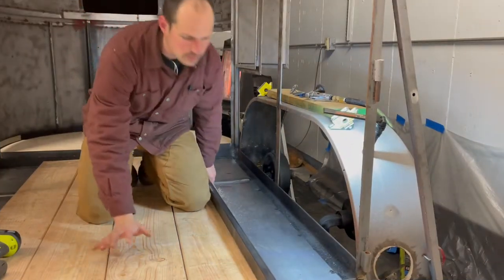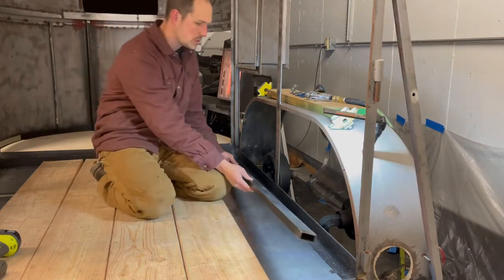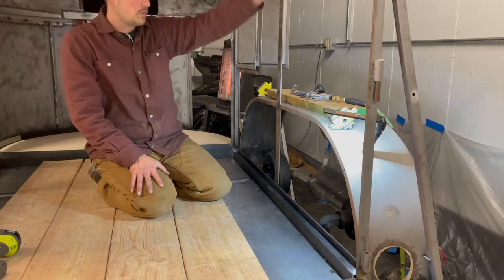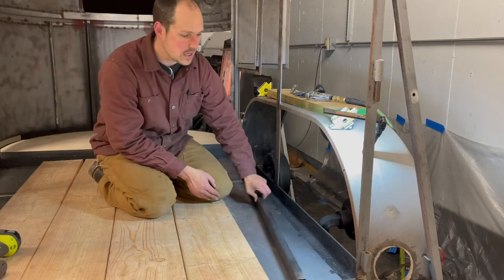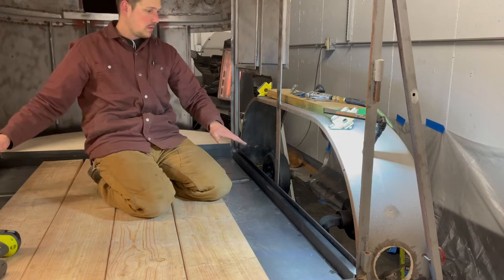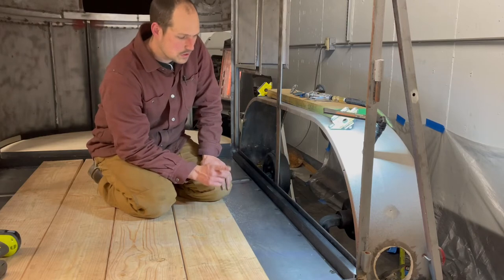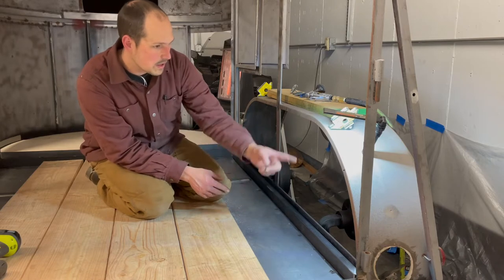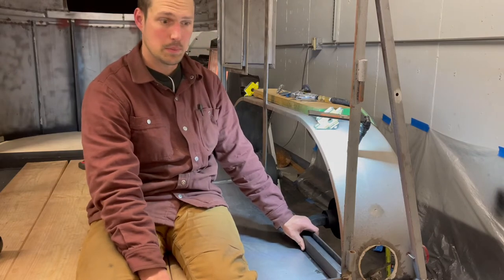Before I put this floor in, I was thinking just for framing purposes that I wanted to put some 1x2 inch rails in here. That way, instead of welding the wall framing directly to the trailer frame, I would just weld this. I'm going to make sure the counters can actually bolt in and out. I'm pretty sure that's the way I'm going to go — that'll allow me to weld some brackets up here out of my 1x4 inch plate. No more procrastination, let's see if this puppy will weld in.